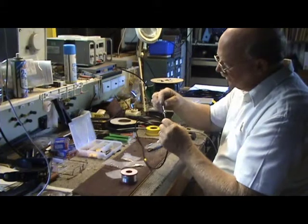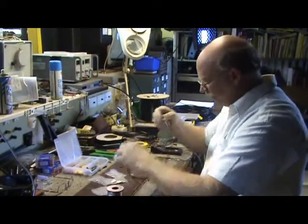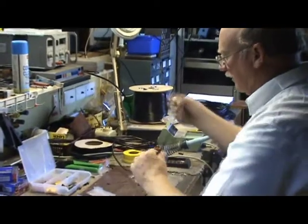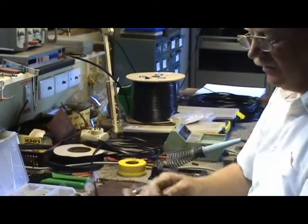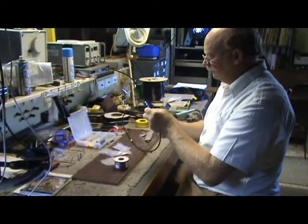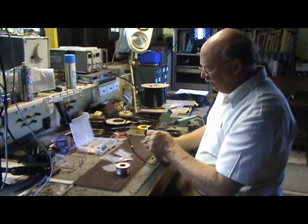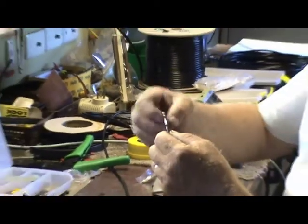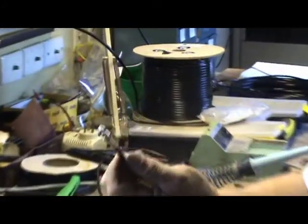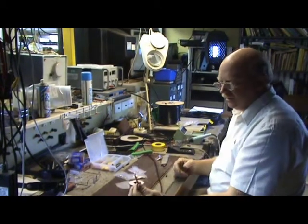So then we put our outside piece on, pull our braid back up over there, slide the ferrule back up over the top, there's our connection, and then we just crimp it off. Unless you've got these crimpers, it is a bit difficult. It's no good using pliers, it just won't work properly because it has this nice even crimp right around. Then we slide up our heat shrink and put it over the end, and there's our connector, our FME connector.